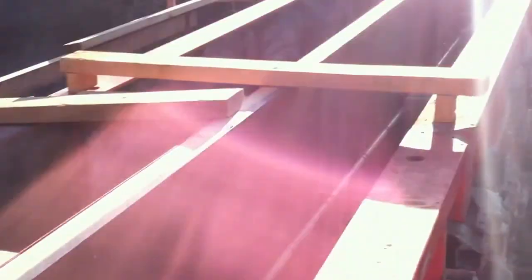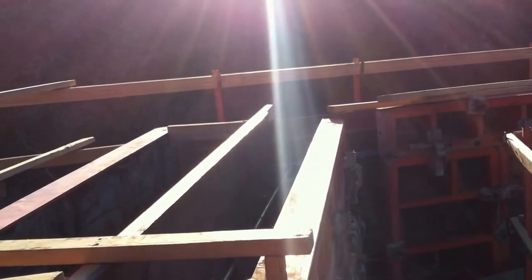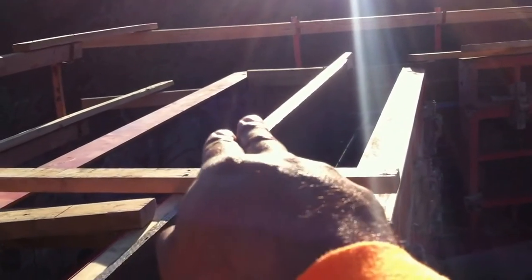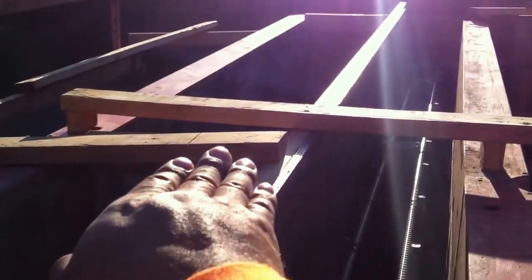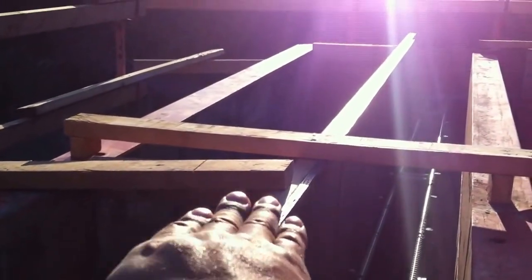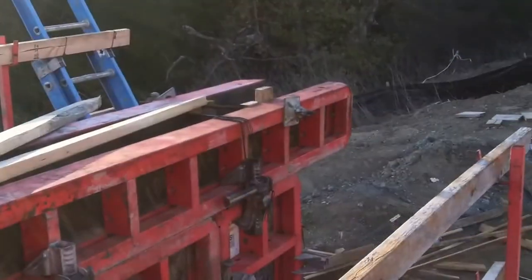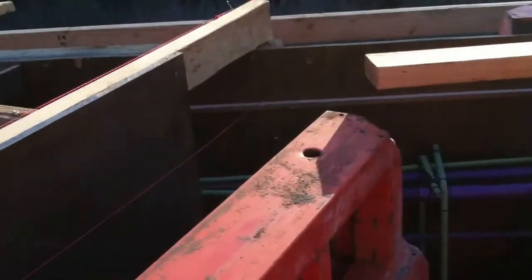This is what the wing walls look like over here. So the bridge deck sits here; the sofa back of this abutment sits here. No concrete goes there — it actually goes way down over here. So concrete steps up to concrete. The bridge sits across flat like that. And then we have this little wing wall coming out to retain soils. And that is a pretty typical abutment.